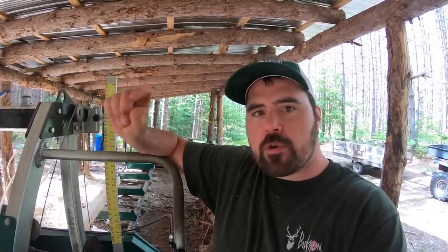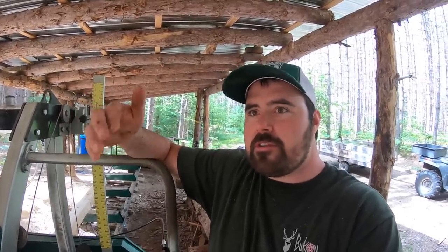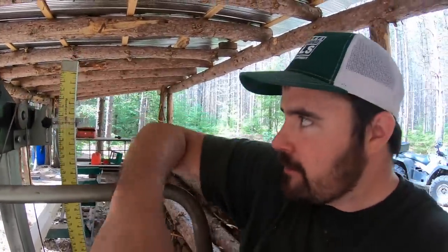Therefore, make your life easy. Do what I do. Cut it so you have a minimum 1/4 inch difference between pieces. So if you're going to cut 1 1/4, make the next piece 1 1/2. Go up by 1/4 is what I'm trying to say. Go up by 1/2. Go up by 1 inch. Don't try to make your life too complicated by trying to read between the lines and cut 1/8 of an inch off a board. You're probably not going to have good results.